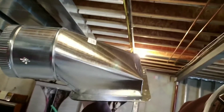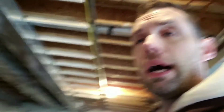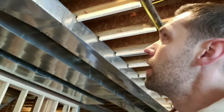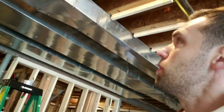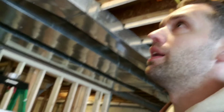Here's what I'll be installing today — this is called a top takeoff. I'm running all the ducts in between the joists. I didn't want anything coming down out of the side or bottom of these trunks because I'd have to frame it all out and drop the ceilings. I thought about pulling down the trunk to install it in the top, but when I tried, it was just too much of a bear. I'd have to disconnect each and every run coming out of it in order to take the trunk down.